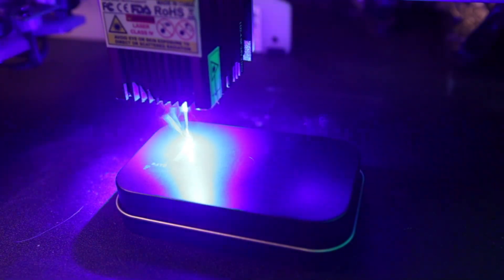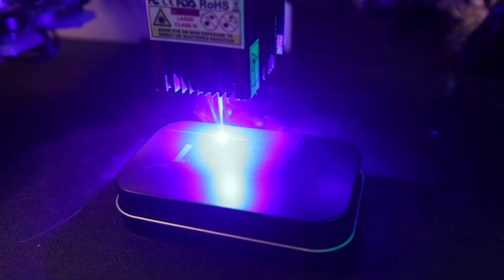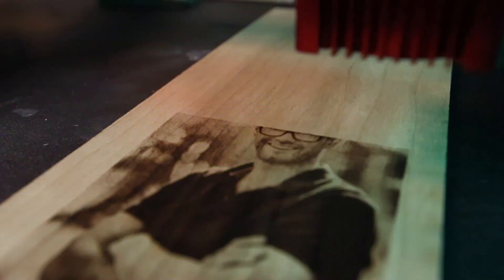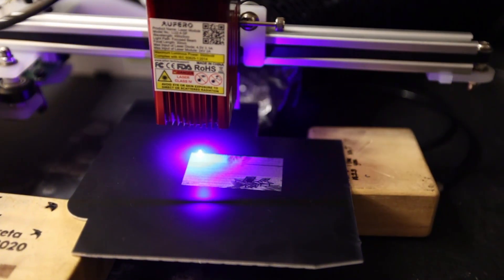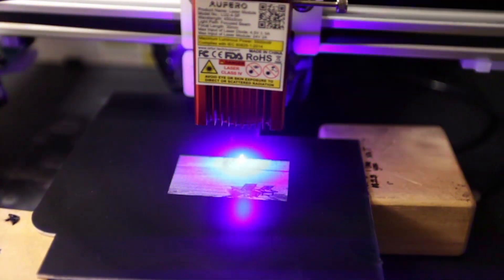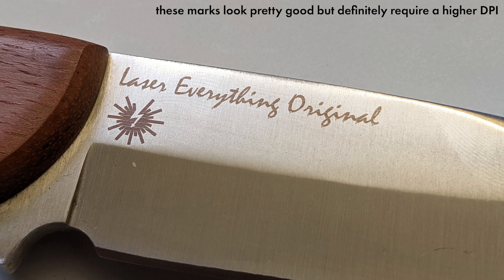The dot size of these diodes is so small we found ourselves constantly surprised at just how high we had to set the resolution to close the gaps in the marked areas. Where diodes really shine is raster performance — these lasers are capable of resolutions double or triple that of CO2 lasers in some cases. If you're looking to do small form factor raster work like photographs, look no further. Even with the LU-2-4 modules, this thing is a raster beast. I had heard rumors that you could get an anneal-type effect from these diodes on ferrous metals like stainless steel. We gave it a shot, and it does indeed work — no amount of scratching or scrubbing removed the marks we were able to make, and they have some pretty stellar contrast.